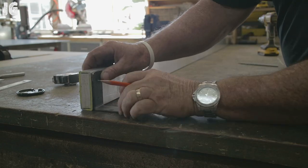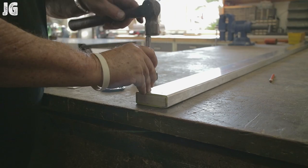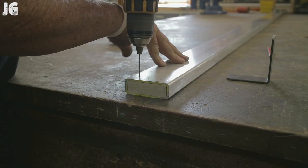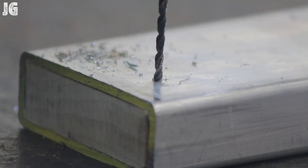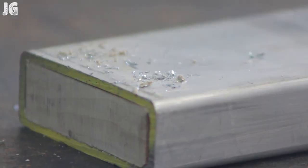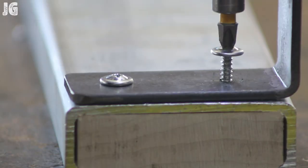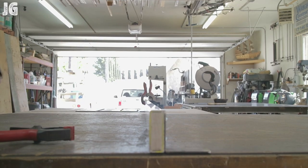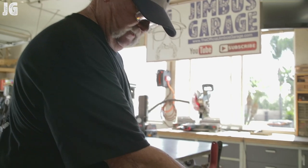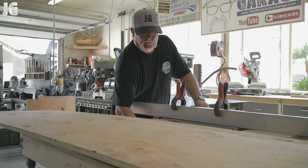This is the bracket that I made on the 8-foot section. I just marked some holes and pre-drilled them because we are going to be using some self-tapping metal screws, but these small pilot holes just help assist the screwing. Even though they are self-tapping screws it worked out pretty good. Then I just clamped it to my existing fence using some spring clamps that I picked up at Sears and double-checked the square.